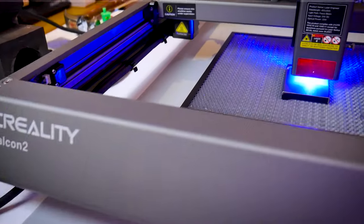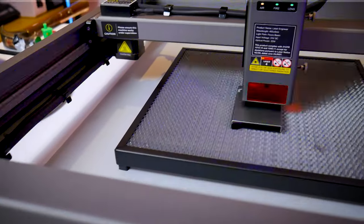While this job is running I want to point out one detail related to laser safety so you don't make the same mistakes that I did. I made my design a little bit larger than the wallet itself because I had the idea of having the laser go over those rounded edges. Unfortunately my design also overshot the top and bottom edges and at the bottom edge of that wallet there's a plastic lever. I mentioned earlier you definitely don't want to laser PVC. Another type of plastic you want to avoid lasering is ABS and that's likely what that lever is made out of. This produced a really bad odor and I had to clear the room out immediately and ventilate as quickly as possible. The takeaway is to try and avoid any bits of plastic on things like wallets or other gadgets that you might be engraving. Despite that mishap the rest of the wallet came out looking fantastic — I did manage to get the pattern around the round edges and the sharpness and quality of the image was excellent. For these wallets I would recommend 800 millimeters per minute for the speed and 80% intensity for the power.